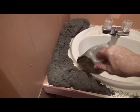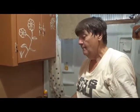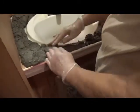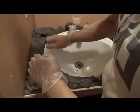I put the cement up there and one bucket of cement is probably going to be enough. I mixed the whole bag but I have other things I can use the rest for. I'm putting rubber gloves on because the best way to make sure the cement gets pushed down into all the corners with no air pockets is to use your hands — I don't have a vibrating machine, which is what they normally use, so I'm going to shove it in and work it into the wire mesh.